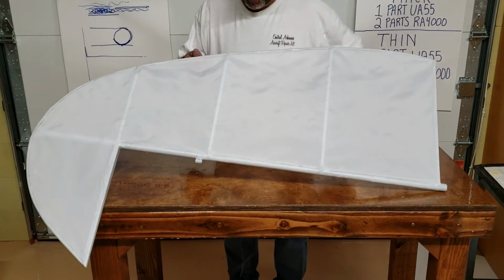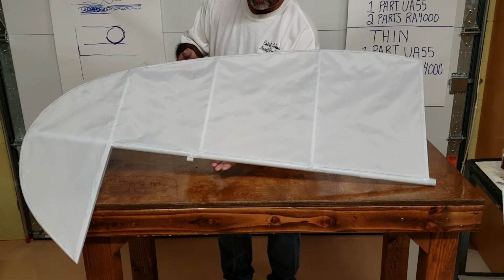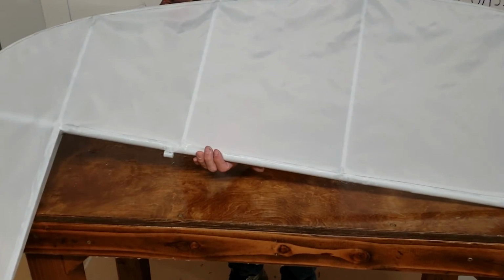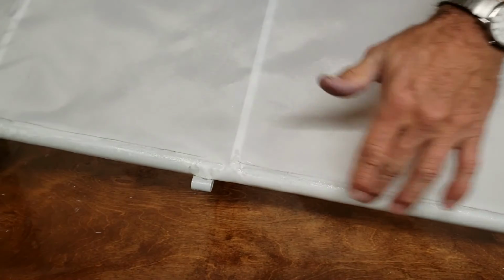And like I mentioned a while ago, your other fabric is going to come around here, so we had to make sure we had thin glue, a couple coats of thick, because our fabric's going to come back around to here. And you can see where I just did it by hand, just put a little line, but you'll lay a straight edge and do it perfect.